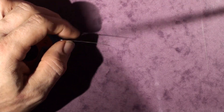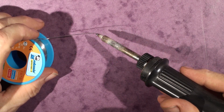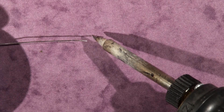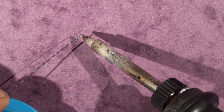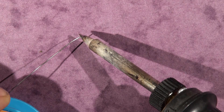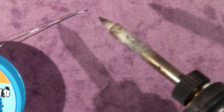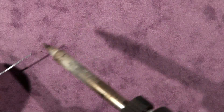The iron is now stable at 150 degrees. Let's try to melt the solder. Not even touching it at 150 — we expected it to melt at 138 and it's not melting at all. I also tried normal 60/40 leaded solder wire at 150 and that doesn't melt either, which is expected. Let's turn it up to 200.